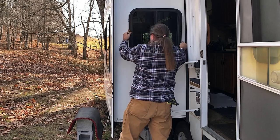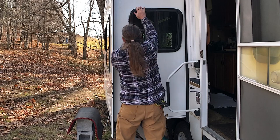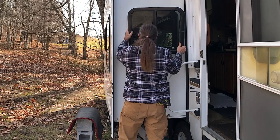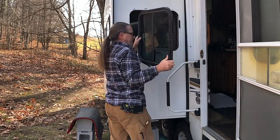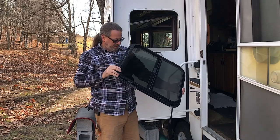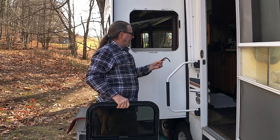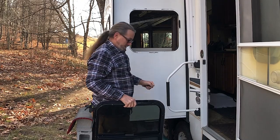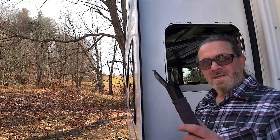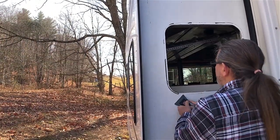There it comes — I can feel the gummy gasket behind it. I'll have to peel this off and cut it off with a blade. A little alcohol on here. Easy enough. I'll clean this whole edge and work on getting my wall thimble in there. A car window ice scraper is working just fine for this — better than a metal blade on here.